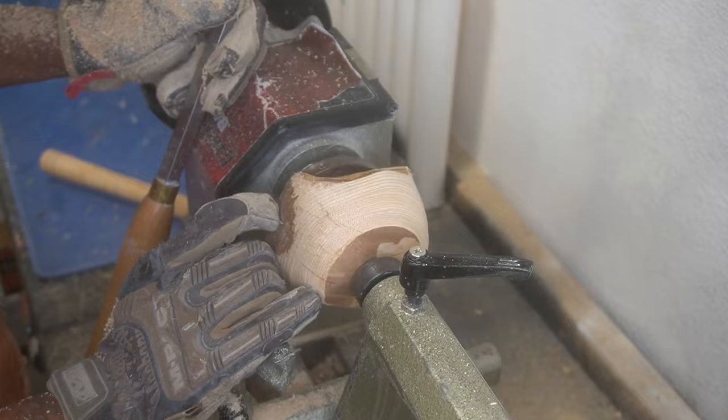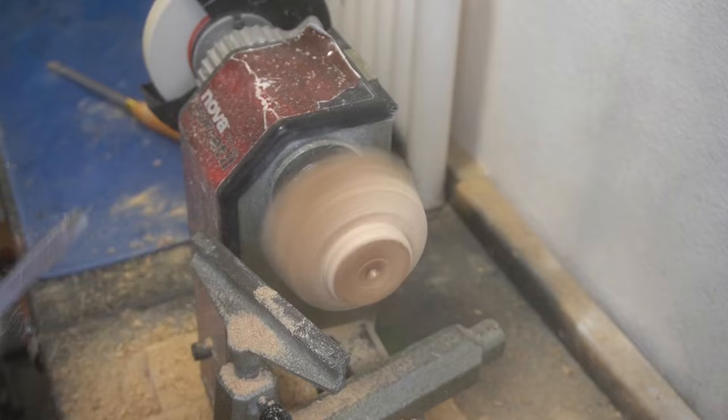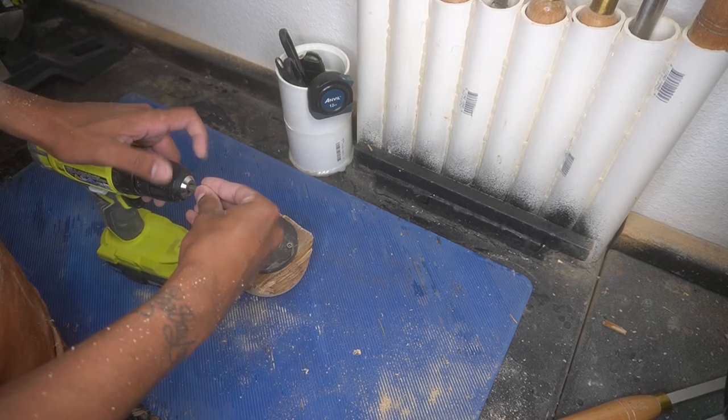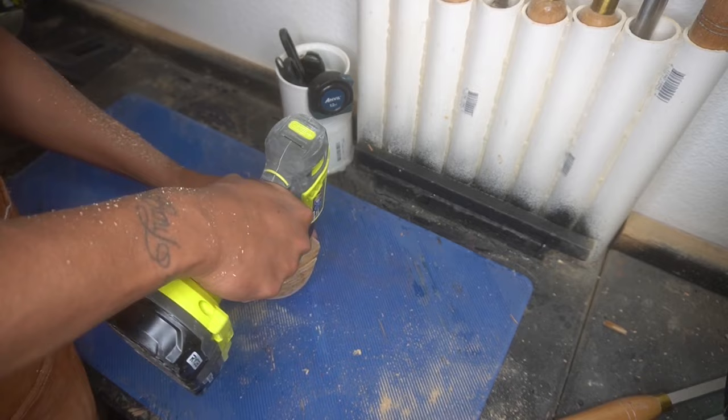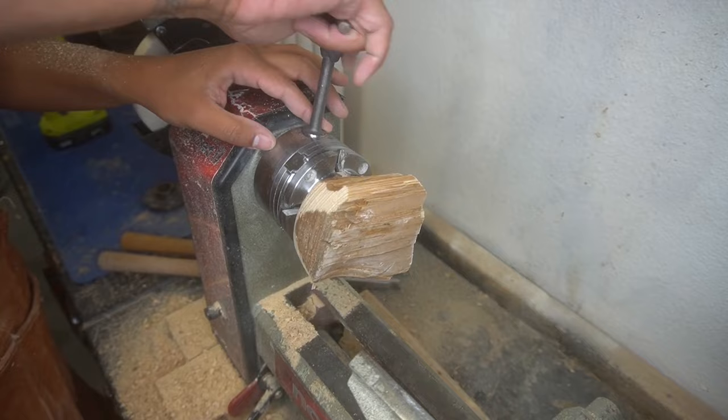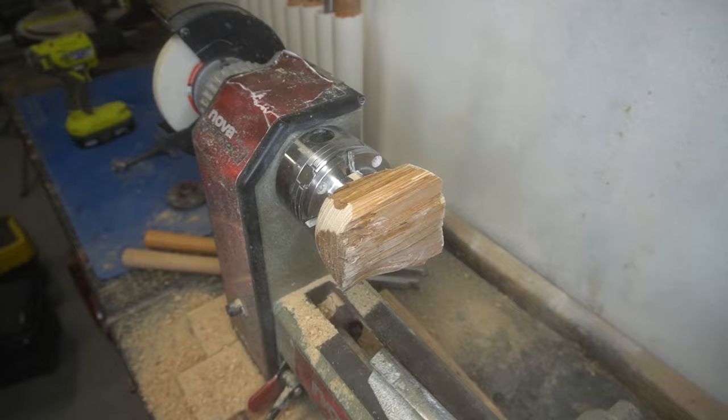That was the whole point of today's project — I really didn't anticipate doing a bonus video but it just kind of turned out that way. So we made a tenon, that turned out okay, and I'm still thinking we can make a decent size bowl out of this. But once we get it flipped over onto the chuck jaws, I realize it's going to be a lot more complicated than I thought. It was a nice piece of flat wood and it did fit into the chuck jaws real nice and neat, but the problem is there's not enough material on the sides to make anything substantial.